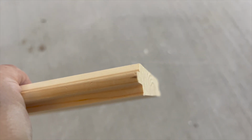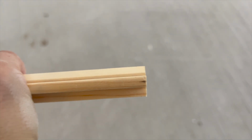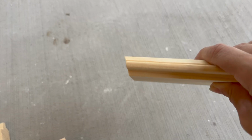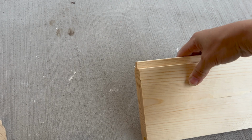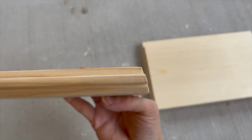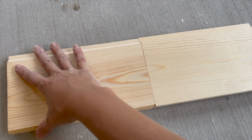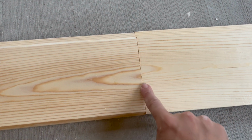If your ceiling is too long, where you have to use multiple pieces of material to span a row, you want to make sure to splice your material where there is a ceiling joist so that you have something to secure the ends of your shiplap into. Where our material joined, we angled each of the ends at 15 degrees so that they overlapped, creating a tighter seam.